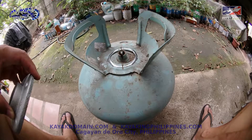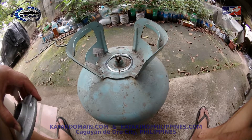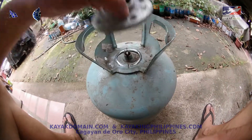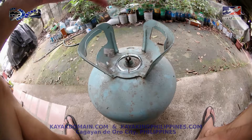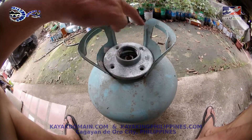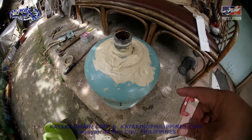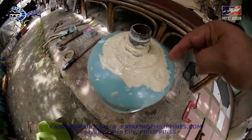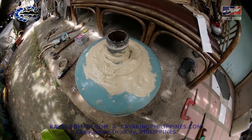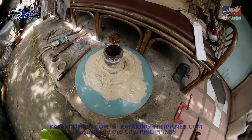As the saying goes, if you want to get it done then do it yourself, and that's what I'm going to do. I'm going to remove this one and using marine epoxy - drill a hole, use marine epoxy, and bolt this here. Let's see if that works. This is now the result. The epoxy is still wet. We got it done: one, two, three, four bolts, covered everything with marine epoxy. We'll let that set and afterwards install it on the system.